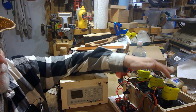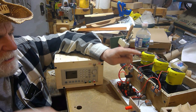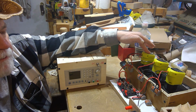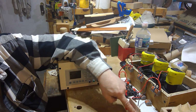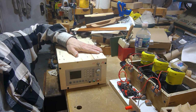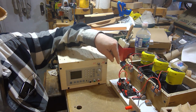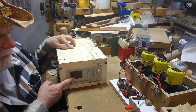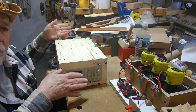This is my 3-battery Ryobi battery hookup, where I can now hook it up, and if I want, I can take the switch and move it this way, and I'm getting 60 volts. They're hooked up in series. If I turn it this way, I'm getting 20 volts out here. So it's not a bad little unit to have in conjunction with this, because what I can do is I can now use this, and I'm going to put it on 60 for now. I can use this to power my meter. So I can run this thing off of an AC power outlet or DC power plug-in.